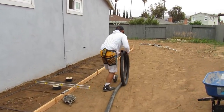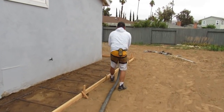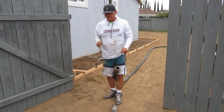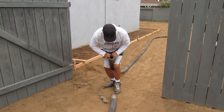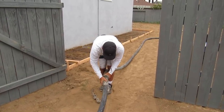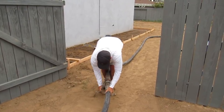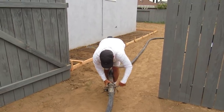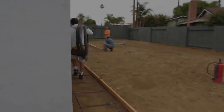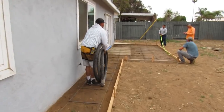With these Olin pumps, the last two numbers are what they're rated for per hour. This is a 545 so it's rated to pump 45 yards per hour. The next pump up is a 565 — obviously 65 yards an hour. There's a 585 — 85 yards an hour. When I was still doing big commercial work that's what I ran, because that'll do a seven or eight minute load wide open. This pump is about a 12 to 15 minute load wide open.